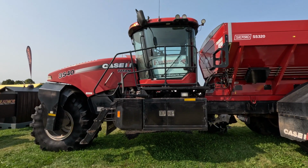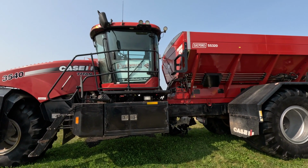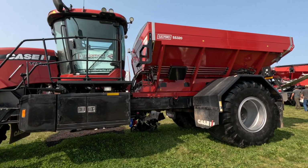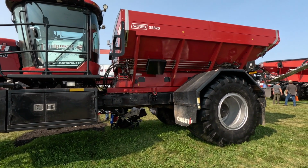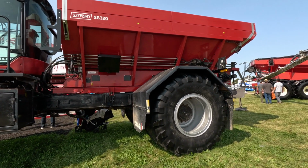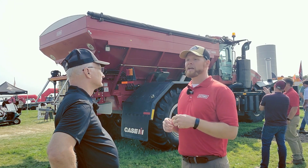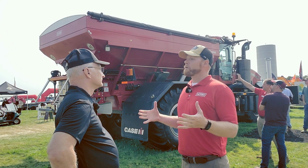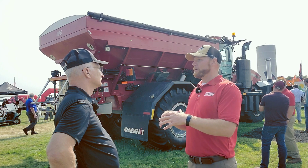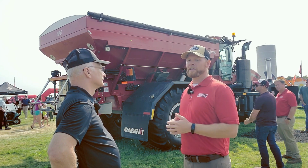And we've made a chassis mounted spinner spreader that's capable of spreading fertilizer at 120 feet. We've got 12 section control, very simple section control design. So we've been using it on our BBI Sniper spinner spreader for close to a decade now. So it's proven reliable technology. And then from our higher capacity MagnaSpread Plus product, we brought in the capability to do lime application with this machine as well. So with one machine, we can do fertilizer or lime.